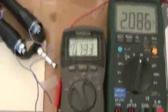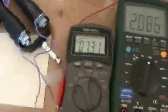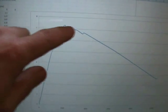I've crudely dialed in various frequencies and measured the current, and attempted to plot that. This is the curve I'm getting. This high point here is around 2 kilohertz — it's kind of hard to be precise exactly — but you'll notice that the inductive part of the reactance is very, very steep. The coil is not behaving like a 130 millihenry coil; it is behaving 5,000 times steeper than that.